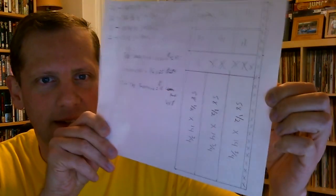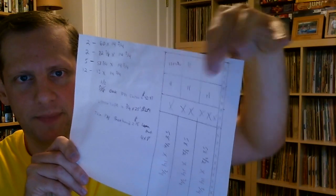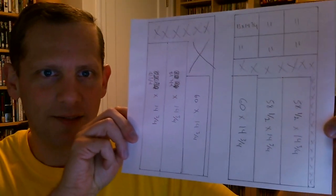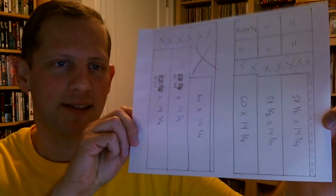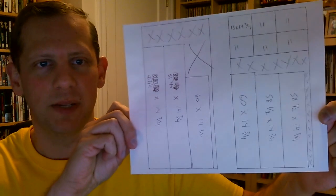I did a more detailed layout sketch. These sheets of plywood are almost $50 a piece, so you don't want to mess up when you're cutting. I have some cutting templates here. Here's the first sheet — some of the cross shelves in the middle and some of the vertical spacing shelves. That's sheet one, and here's sheet two and three. I'm not going to have too much waste. There's no way to lay this out with just two sheets, so we went with three, and I'll have some leftover for smaller projects.